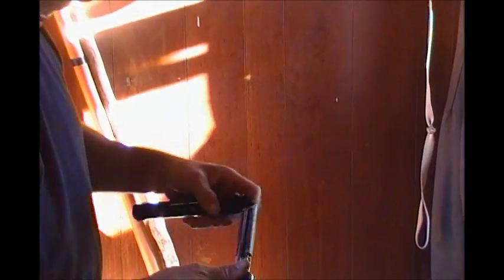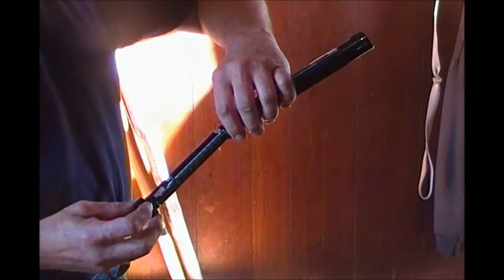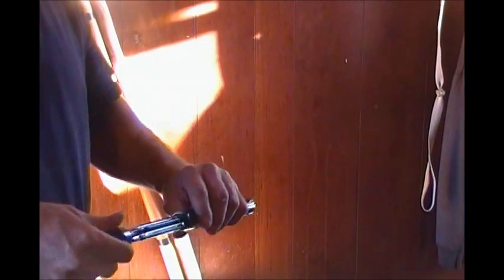We're going to look at the thermometer. It's going to say our wet bulb temperature is 69. Okay, that's our wet bulb. It's something wet on the end of the thermometer that you spin inside the return air, which is the air in this room — that returns to your furnace. That is called return air. We find out what our return wet bulb temperature is; we're going to call it 69.